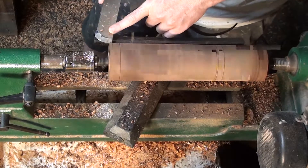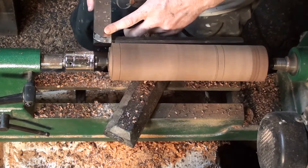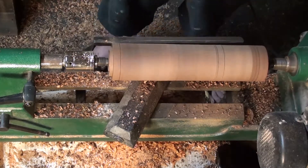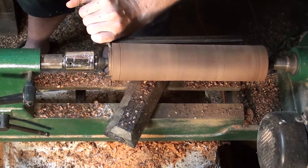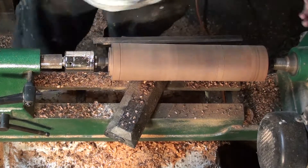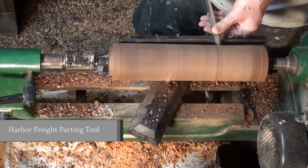When using the calipers to measure the piece while it's moving, you need to make sure to round over the tips of the calipers so that they don't dig into the wood — otherwise you might lose control of them and they might fly across the shop. I'd like to apologize for the camera quality; I'm using a Sony Handycam that's about 10 years old for the first portion of this video, and while I was editing I noticed that it seemed to be a little glitchy.